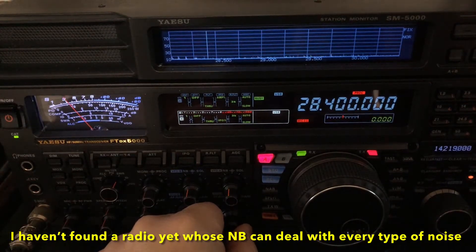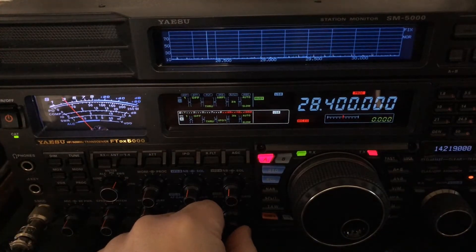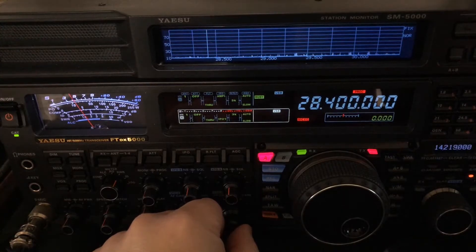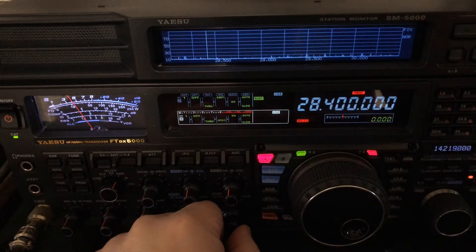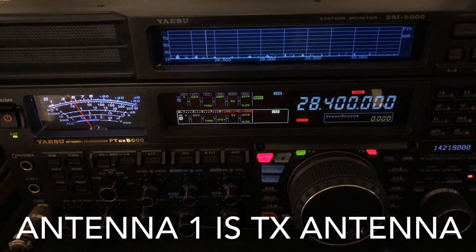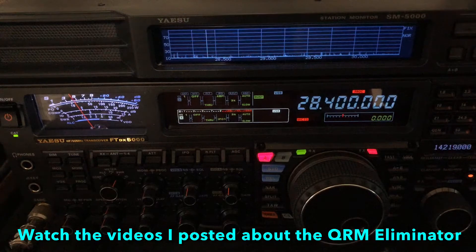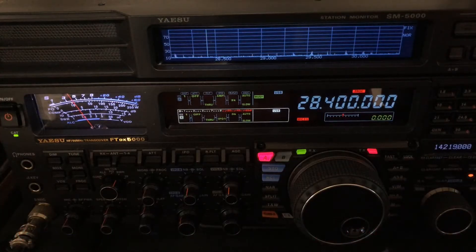It is kind of cool that you can use a QRM Eliminator — I've covered this in other videos so I'm only going to give it an honorable mention here — that if you're not dealing with noise, if you put up two horizontal dipoles at the same elevation but perpendicular to one another, you can use one as your main antenna and hook the other one up to the secondary antenna on the QRM Eliminator. You'll rotate those knobs to get the signals equal, and then you can use the phase knob to effectively rotate a receiver array.